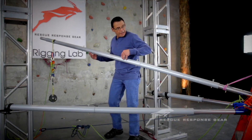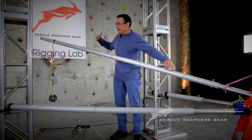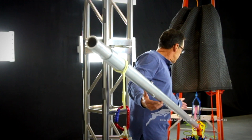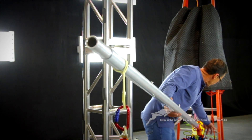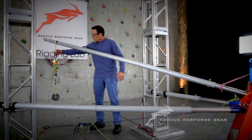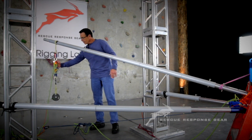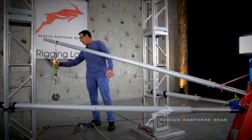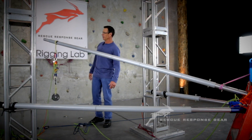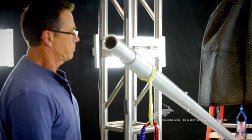The ratio right now is 11 to 1. This represents an aerial ladder extended 80 feet over a fulcrum that's roughly seven feet back from the pivot point, so our ratio is 11 to 1. We're also looking at the effects of the resultant in a couple of different scenarios. We have a 4 to 1 with a change of direction coming straight off the tip of this hypothetical aerial ladder, and our weight is two and a half pounds.